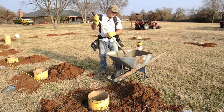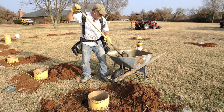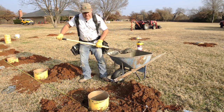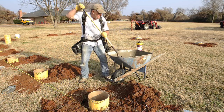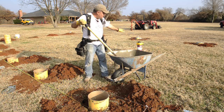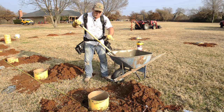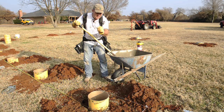Now we're going to pour concrete into these sonotubes. It's taking about three bags of concrete per sonotubes. It's a 24-inch sonotube - 12 inches across, 24 inches tall. I've already set the sonotubes pretty close to grade with my laser level. This morning I set seven of them because I only do about six or seven a day. You get pretty worn out after that. I went and dug them out and set them on 6-foot centers, then set and leveled them with my laser level.